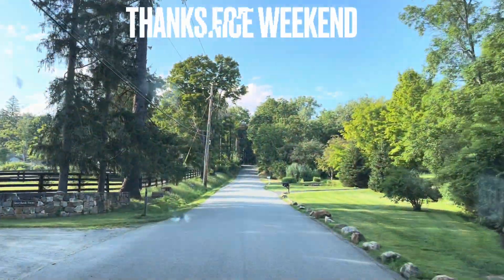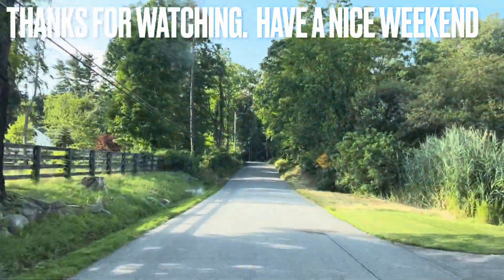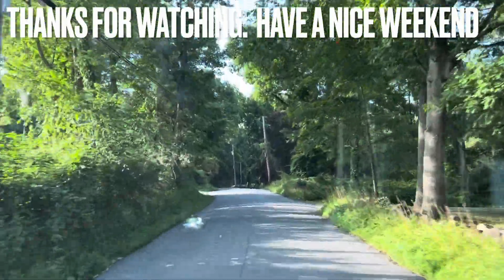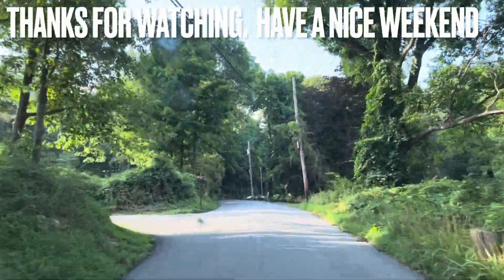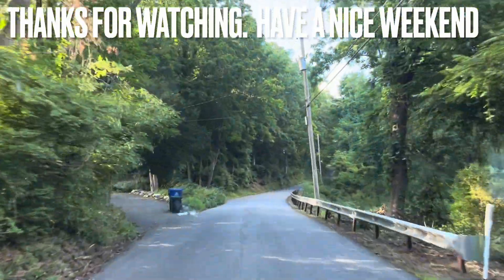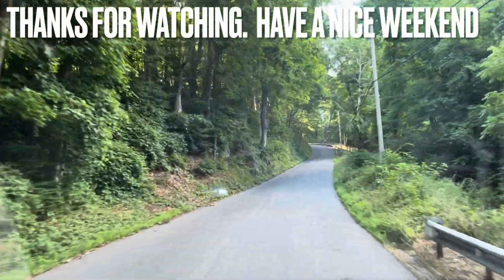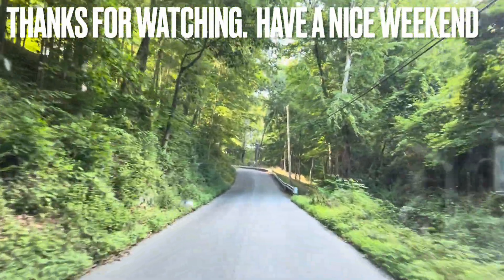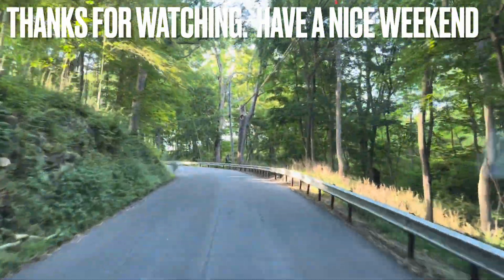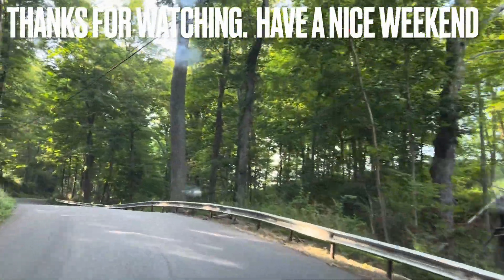So that house with the Pro 8000 — the racquetball court issue — I showed it came down to 58 degrees in that room, just running and running. I went out to my truck and didn't have a wireless sensor — only a wired one — so we're going to return on Monday with the wireless sensor. He's also got a major refrigerant leak in that Fujitsu, so we're going to do a leak search Monday as well when we return.